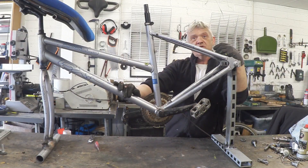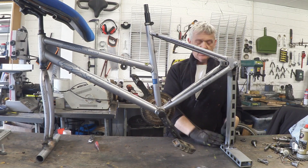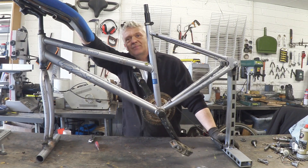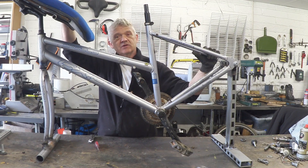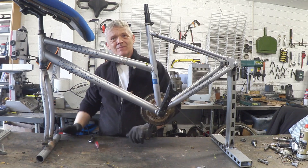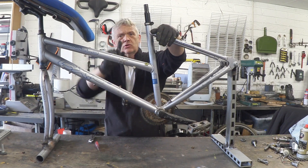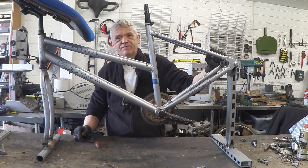Believe it or not, that's the basic machine finished. All I did was take the original bike, welded on this bit of pipe here, welded on this T-section here, there's the strap bar to stop everything moving that way, and then I welded that onto the handlebars and bolted it straight back onto the handlebar fitting. Very little in the way of adaptation. I've done a fair bit of welding but equally you could bolt this up if you wanted to. That's our power input — our legs. I've sat on this and pedaled like mad and it does just fine. But we have to take this chain, put it through a gear system, and get it up to the shaft turning in either direction so we can attach different machinery. The next task is to fit that gear transmission.